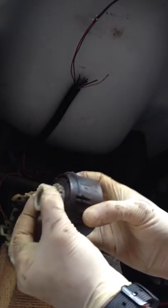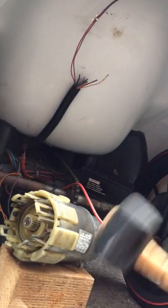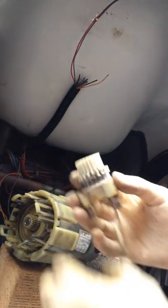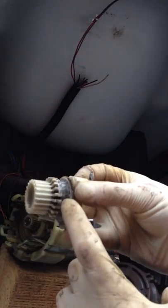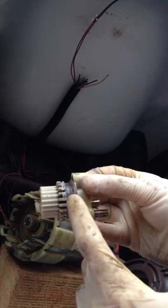This has also been used for a little while — this is well, well worn. So you pop that off with a little tap — cool, get it off there. You can see where it's so worn: this is where the bearing would normally go on here, that would normally be thick plastic, and you can see my finger can get in the gap there. It's worn a few millimeters all around the outside.